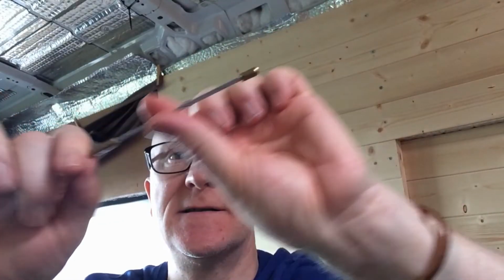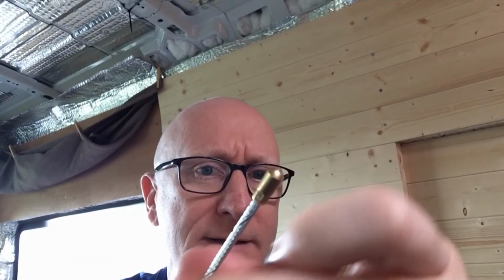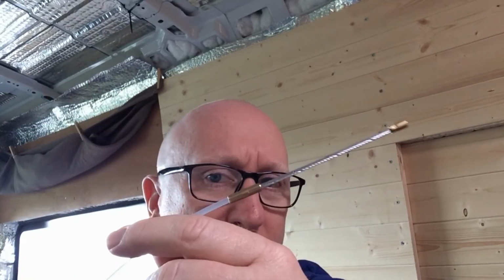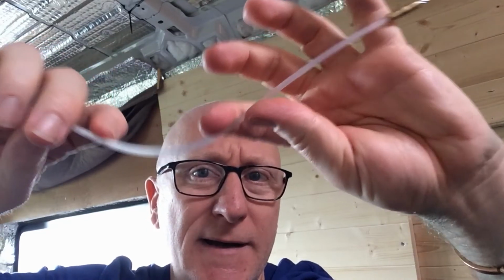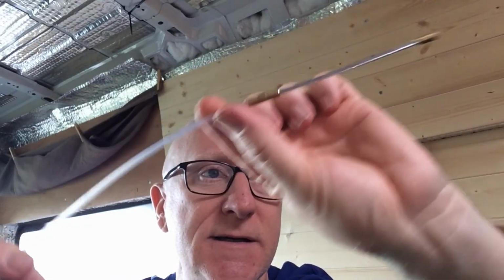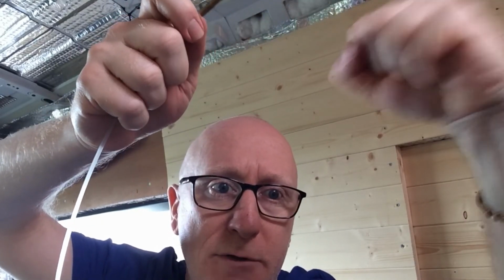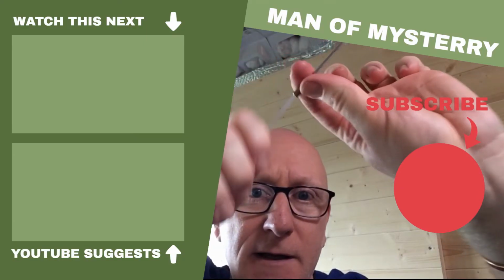Well, the rain's back, so I've had to down tools again, but I've looked this thing up and it is called a Draw Tape Nylon 10 meters, and it costs $2.99 from Toolstation. It has this metal bit on the end which is good for guiding through, and it's got a nice rounded bobbly bit on the end, so when you poke it down the conduit it goes really well. And it's bendy but it doesn't kink, so it just works really well. And what I did, you might have seen before, was fix my wires onto this and then thread it through. And then when I got to the other end, I detached them and coiled them up and taped them so that they weren't going to come back up the conduit. And then I pulled this back the other way.